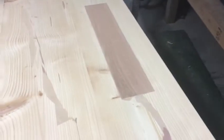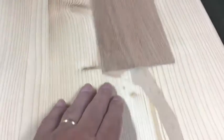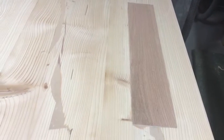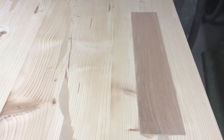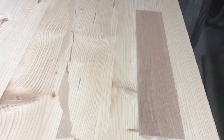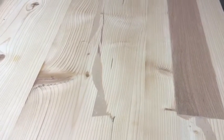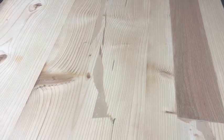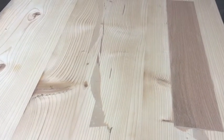There's the table top — the bottom of it — with the Dutchman complete. You can see that they're completely recessed now. After planing them to thickness and sanding, they sit flush with the table top. These are bigger Dutchman than you would usually see on a table — they're for small repairs normally. The idea was to keep this table as thick as I can; it's about one and five-eighths inch thick, maybe one and three-quarter. If I had elected to machine this side without any defects, I would have had to take at least another quarter inch off, and one of the desires was that the table be as thick as possible.